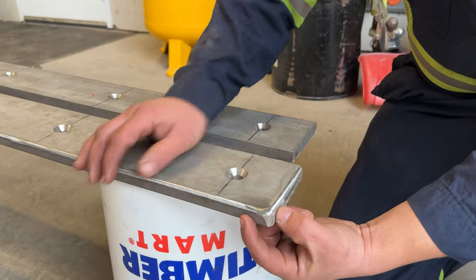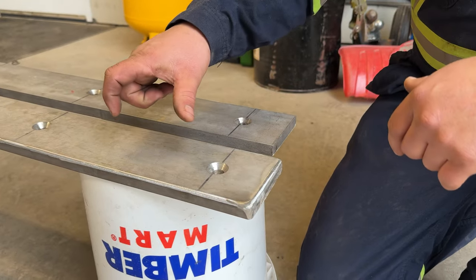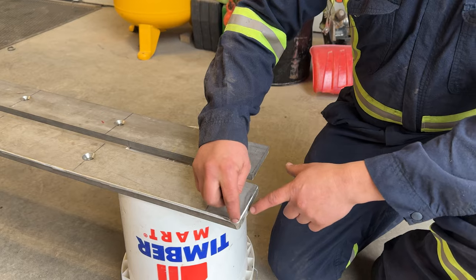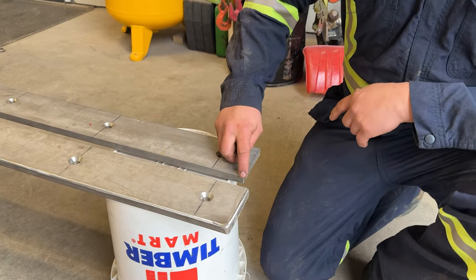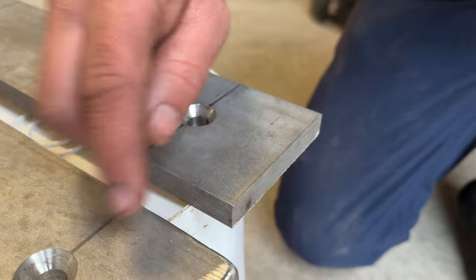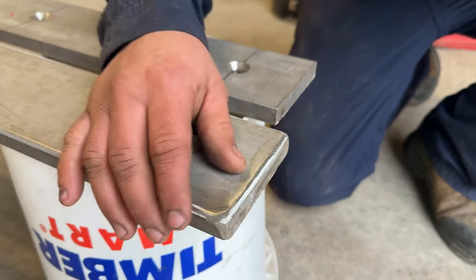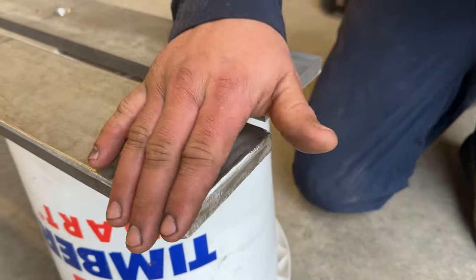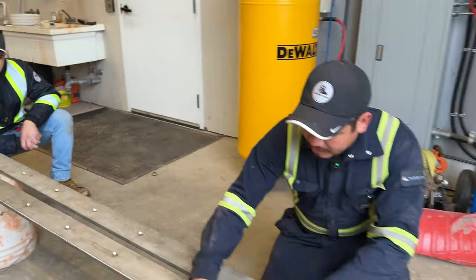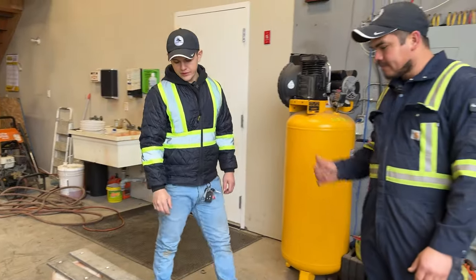I grinded like a good portion in here, because when you have the blower already scraping the driveway and you move side to side, you can leave scrapes with this. Look at these sharp corners in here, right? You want to avoid having very sharp corners like this one. So this will be just the perfect setup. And then obviously the whole line that is gonna scrape, you want to have it dull compared to how it comes, right? Definitely really, really necessary.